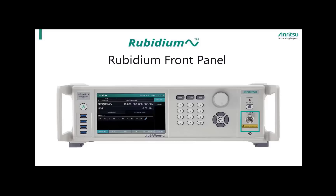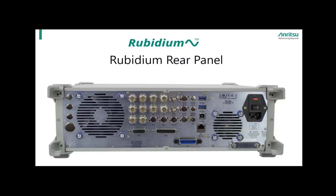Now that we have described all hardware components on the front panel, we can move to the rear panel. Note that there is an option of Rubidium that features front panel BNC connectors, which offer easy accessibility to modulation and ALC input connections. One thing to notice quickly about the back panel are the numerous BNC input and output connectors. For MG3690C users, Rubidium signal generators have all the same functionality and back panel interfaces as the MG3690C, making the change from MG3690C to Rubidium easy and simple.